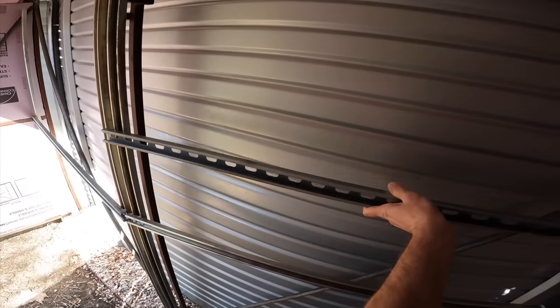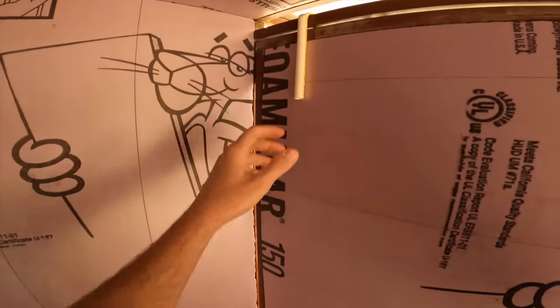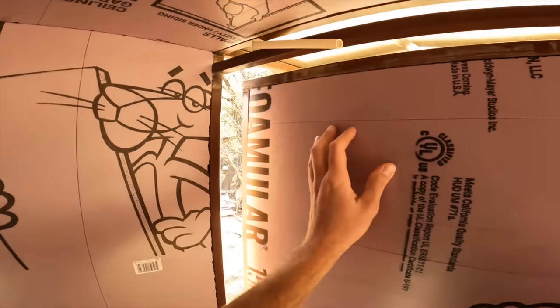I wanna make sure that it rusts here and it doesn't sacrifice the anodes that are buried underground as part of the tank install. And the whole point of all this was to have this tank outlet come to pipes. That's gonna go to a pump, a pressure tank, and a series of filters. And then the filters are gonna be mounted on this back struts on the wall. And you can adjust these struts to whatever dimensions you need to make mounting the filters easier. Going back out the other side of the pump house.